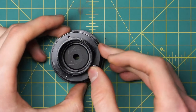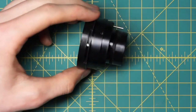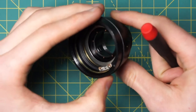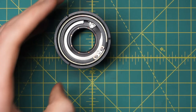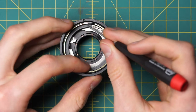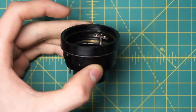Now we have both sides of the aperture fully exposed. The lever back here actually stops it down — that's the stop-down lever directly. There's also a little track system with a knob going back and forth, which is how the aperture control ring couples in. Looking at the front, you can see the different mechanical couplings going into the aperture and diaphragm — they're all layered on top of each other inside the diaphragm housing.